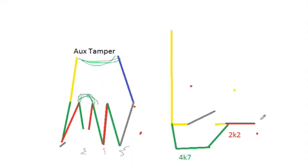And then from here, we'll then have our spring. There's nothing really much I can do as a spring. So here we go. This will be our tamper spring. And then on the other side, going into the panel, into your other side, as I said. And essentially what will happen is we'll come out of here. If this was connected, it will then go straight through the 2K2, through the tamper spring because it's currently closed, and then into your panel, and it will be a secure 2K2 zone, or 1K if it was a Galaxy.